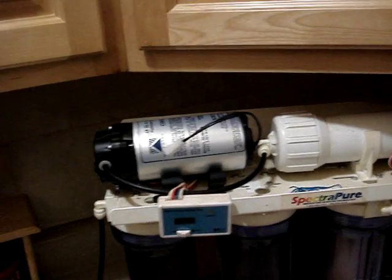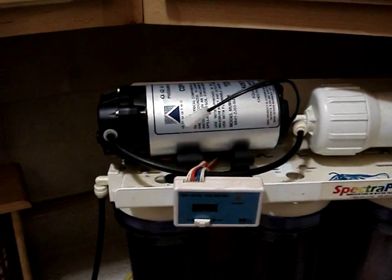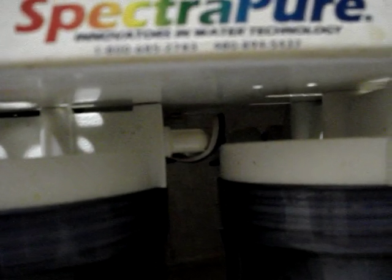It is recommended that this pump is installed right before the RO membrane. Before I had this pump, the RO membrane was more towards the middle of the unit, and I just slid it that way keeping the connections the same. On my unit I've got black tubing going into the first stage, which is connected to the second stage by a connector. The second stage has an elbow that goes out through the back, and before the pump was installed, that elbow with the black tubing would connect directly to the TDS meter and into the RO unit from the back.